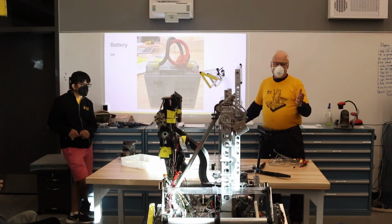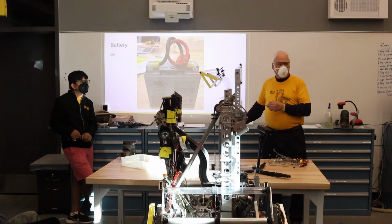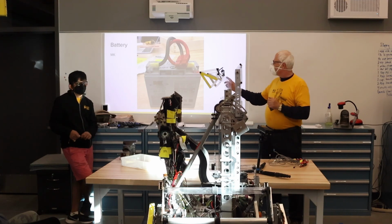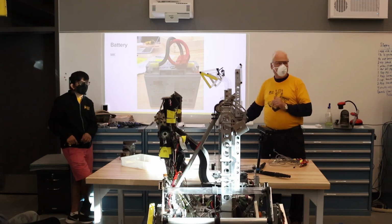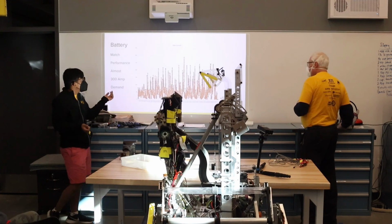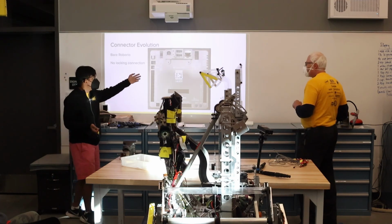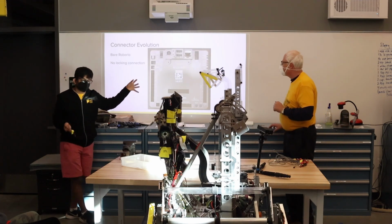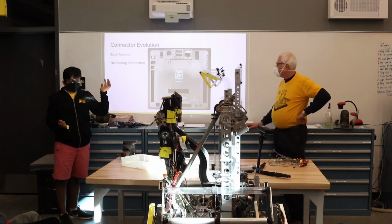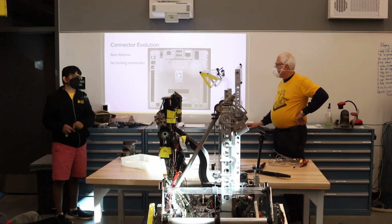So there is no additional electronics on the board itself. It's purely to get to the new connector system and also to map out the signals you get from the center connector. It also makes it a lot easier to manufacture in-house, because even though we have a method for reflowing the resistors and more complex components, it's a lot easier for a new member to get into it and start soldering the connectors on.